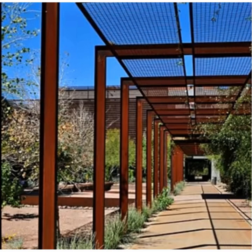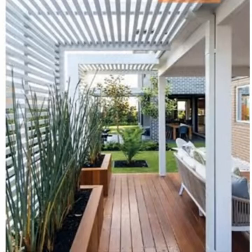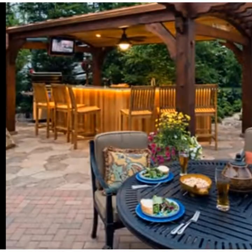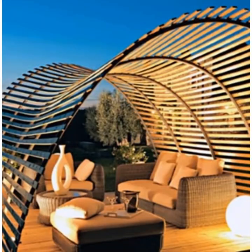Step 7 — Cut posts with a jigsaw. Transfer your mark completely around the post using a combination square set from the bottom of the post. Cut the post with a 10-teeth-per-inch wood blade in your jigsaw. You'll need a fresh blade for every post you cut. We found the jigsaw a lot safer, quieter, and less dusty than a circular saw. This composite polymer is only about 1/2 in. thick but pretty hard, so expect to use a new blade on each column. To make cutting the columns easier, leave them on sandbags or mulch bags to keep them from rolling or vibrating as you cut.